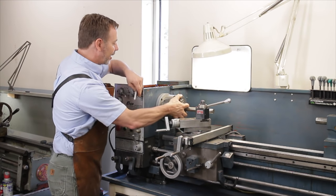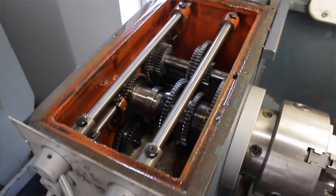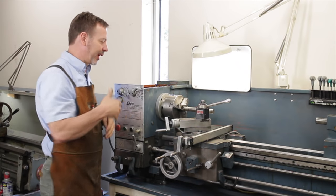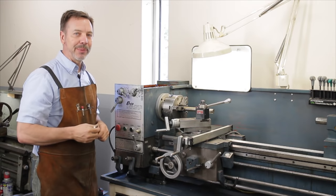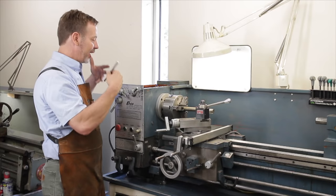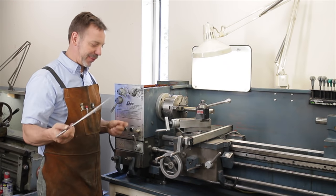There's a little grind here — that's actually because it's not engaged correctly. All these are flat-tooth gears, so they don't mesh as readily. You just have to rotate until the gears come together without hitting on top of each other. A visual inspection here is really important. The other thing is a magnet on a stick — this gearbox is bathed in oil, so there's a puddle in the bottom that splashes up and feeds everything.